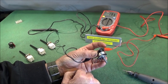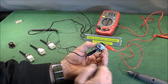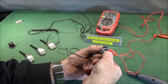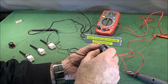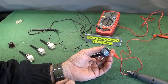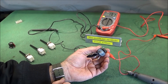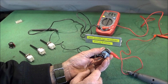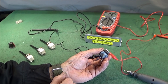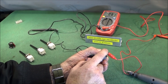They're quite expensive for what they are. I've tried to locate this one in China - it's a special one - but I can't seem to find it. It's special in that when the potentiometer is turned fully anti-clockwise, the switch at the back is bridged, and that's to actually reset the circuit board so you can turn the lathe into reverse. If the switch mechanism breaks inside, you can switch the lathe straight into reverse without it actually stopping, which is not good for the lathe, so it's important to change this one as soon as that switch breaks.